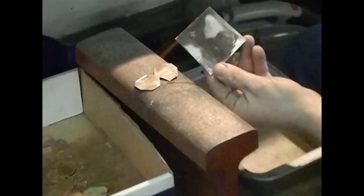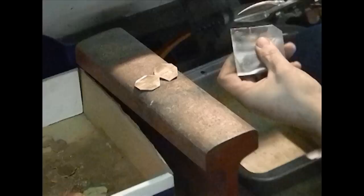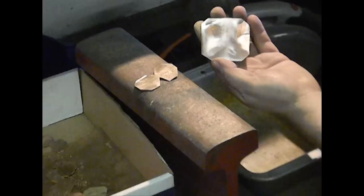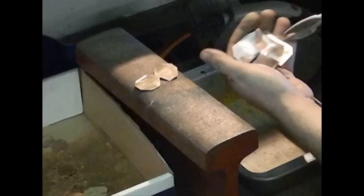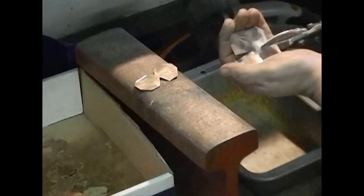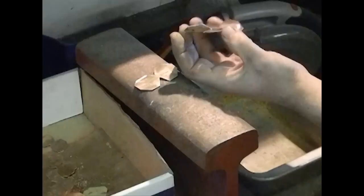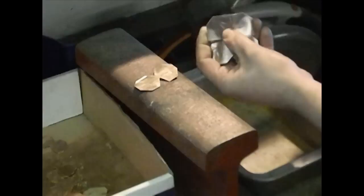To correct this problem, I'm taking a square piece of copper — approximately two inches by two inches. What you're going to do is start off by cutting off the four corners. Then put a hole in the center; you can do it before or after you cut, it doesn't really matter. Take your tin snips and go almost into the center and make four cuts on your four sides. These don't have to be perfect. If you're using a really good pair of tin snips, the copper kind of creates steps, which comes in real handy for the next part. These sharp edges need to be cut down on an angle, about the same angle that you cut your corners.